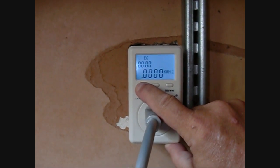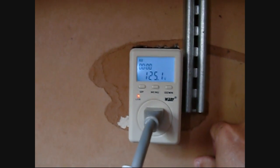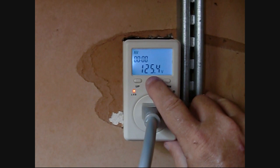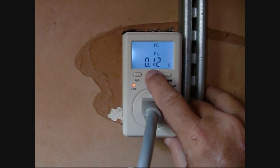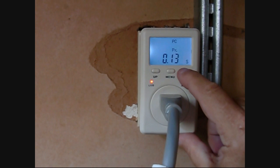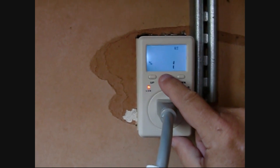It'll come to a clear - all clear. So now our time is reset. First thing I want to do is put my electrical rate in here per kilowatt hour that I pay. You hold the menu button down until it changes to a setup menu. It's sitting at 12 cents, so I am paying about 12 cents. You can increase or decrease that, and then you hit the menu again and it locks that in.